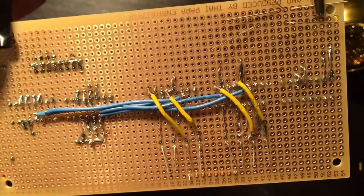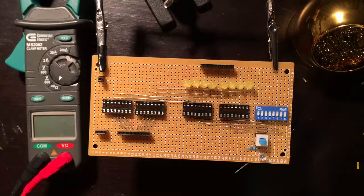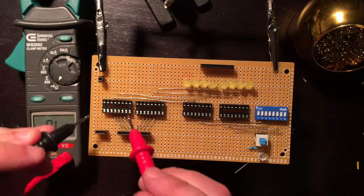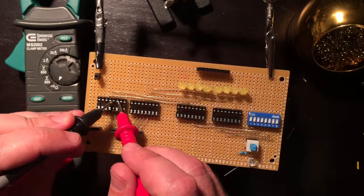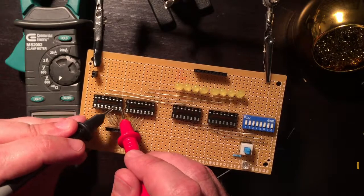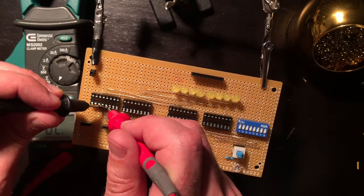Okay, I got the LEDs jumped. Let's do some continuity testing. Okay, so I'm not done yet, but I want to stop now and just take some continuity tests to see if I've bridged anything before I keep finishing up. So let's start. Do the simple ones, let's do the side-by-side. So beep is bad, so if any of these are touching underneath, whoa, that's me touching. Side-by-sides are the most common to get bridged.